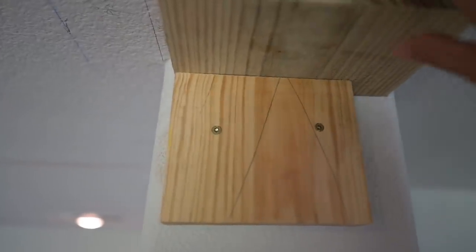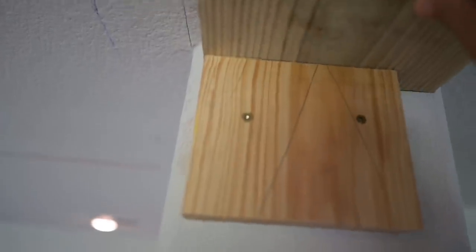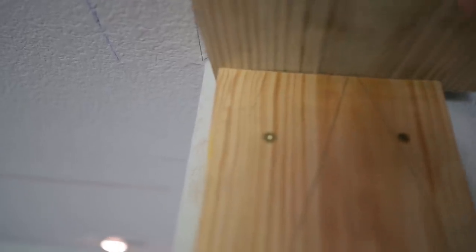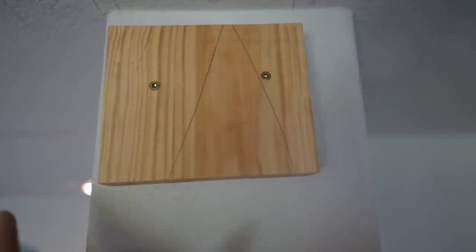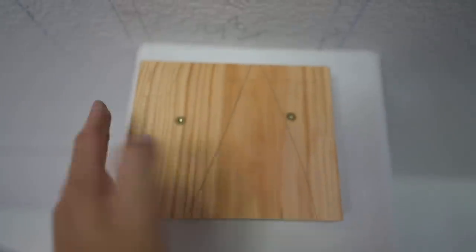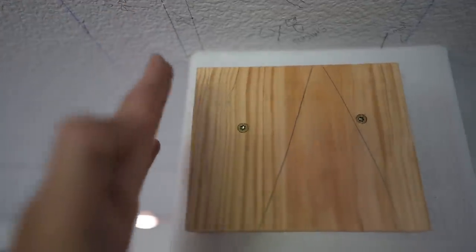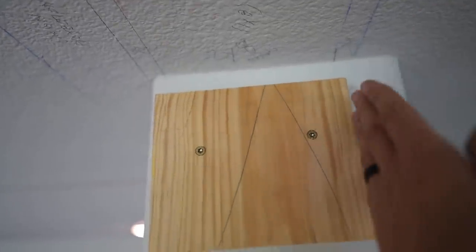Let's have a look at what we've got. That's in place now. I'll take the big unit and slide it up into there. I left it a little loose with some slop because I don't want to be fighting it. Some of you are probably wondering why this isn't centered on the beam or on this wall — it's because we want the crown molding to be continuous without a weird transition against the beam. There will be no crown on this side, so it's all focused on the other side.